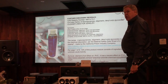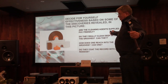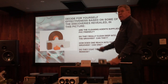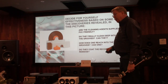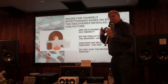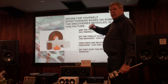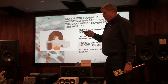So the question is: you just bought this machine — can it do anything to a record? First, look at the bottle. Any chemical name? If no, don't buy. If there is a chemical name, is it friendly to PVC? If no, don't buy. If yes, can it clean into the grooves? Of course not — because the water droplet is larger than the groove, so you only get surface cleaning. And the problem is the record will have residue because water is repelled by the record, and all you're doing by vacuum drying or blow drying is coating the record.